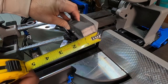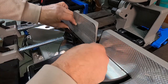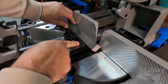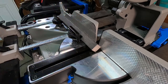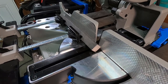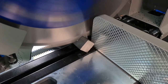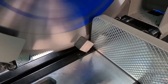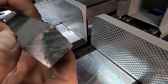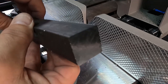Let's step things up a bit — I've got some one inch thick solid steel here. I'm going to cut it on its side to help make an easier cut. I've got the v-blocks installed on both of these front clamps and I'm going to tighten them down into place. And there is the clean cut made in my one inch thick mild steel.